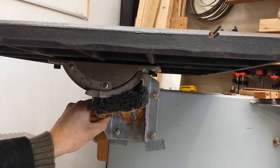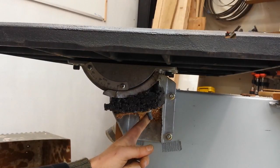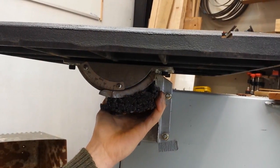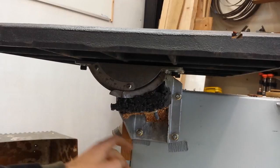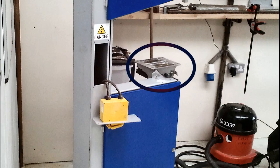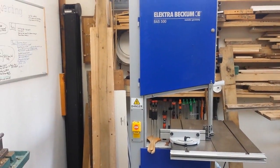The trunnion area has been massively beefed up. The bar that goes through was replaced with a high tensile 10mm bar — it was an 8mm one — and it's got a load of epoxy granite cast into it. This part was very weak before, seemingly just a aluminium or magnesium cast part. The trunnion itself rang like a bell and bolted to the table but was quite unstable. Epoxy granite to the rescue — if you don't mind the smell.